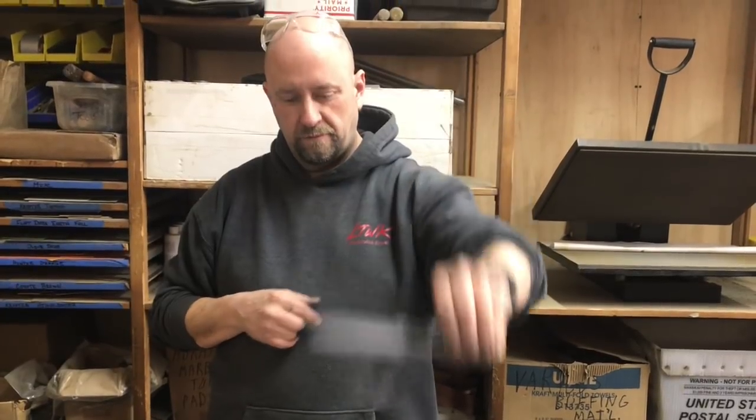It just takes a little bit of time, a little bit of patience. If you're not used to doing it, keep using the Sharpie markers so you know that you're hitting the whole blade from tip to plunge line. In the next video, we'll teach you how to put the burr on there when it's completely dull in a variety of ways. Since we've already done it in a shop, we're going to do it using non-conventional items. Then come back and buff it, strop it however you want. And in another video, some survival sharpening — similar but different — because we might need to have a sharp knife quickly. If somebody has questions on the video or wants me to go over different aspects of sharpening, reply down below and we'll try to reply.